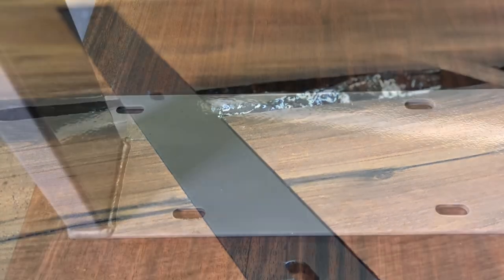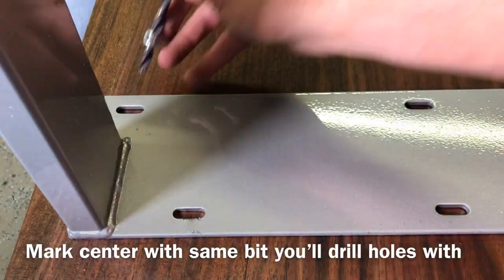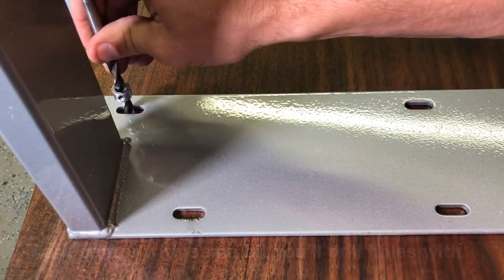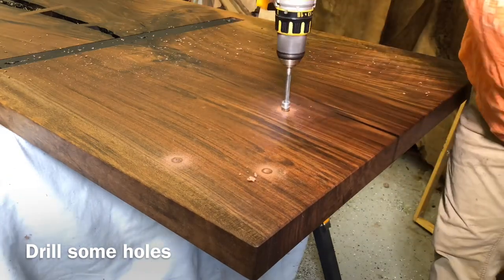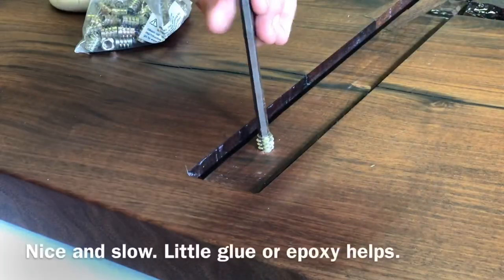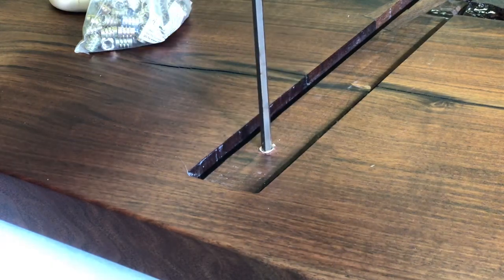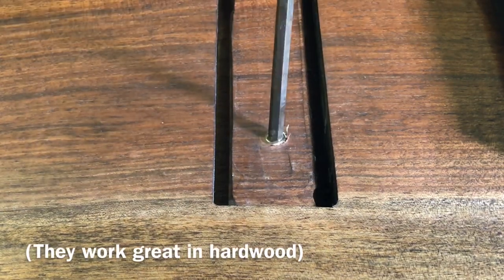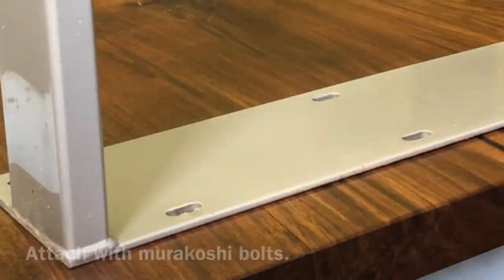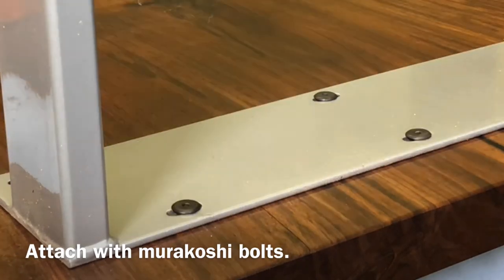Now I'll show you how I add the threaded inserts. I didn't have a lot of footage of this so I'm going to show you on some steel table legs — it's the exact same process. I use the same bit that I'm going to drill my threaded inserts with, and I use that to mark the center line once they're installed. Then I just use an allen key to slowly thread them in. I have a little bit of Titebond 3 on there — epoxy probably works a little better. These are the easy lock threaded inserts for soft wood; they work really well for hardwood, so don't worry about using them on any type of wood.